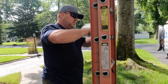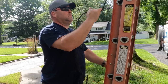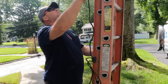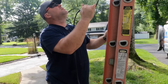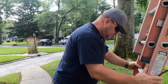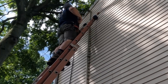It's an old house with an old meter. The meter was inside the house — it's the old school meter — so we have to apply for a new meter on the outside of the house, but that's for another video. Right now I want to turn off all the fuses and then cut out from the service before pulling that meter. Because it's an old school meter, there are two sets of line wires for 240 volts — 120 volts each leg — and then a load side that goes right to the panel. It's not a meter that pushes in; it actually has four lugs at the bottom, two line and two load.